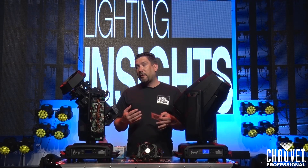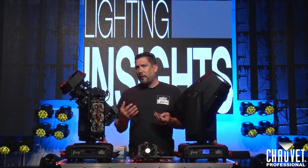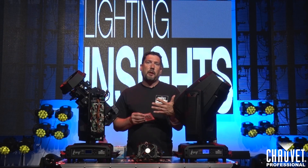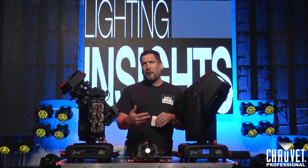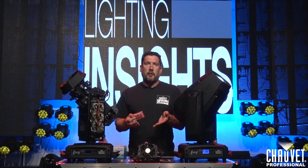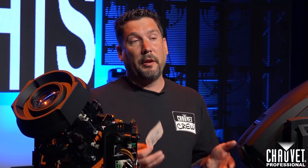If you're going to take the time to clean your optics — which is a really good idea when fixtures have been on tour exposed to dust, grime, fluids, and pyrotechnics — these atmospheric elements can cause major problems inside your fixture and reduce output because particulates gather on your optical systems. Avoid using a generic paper towel or your t-shirt. I recommend going to the drugstore and getting some gauze pads. They come sealed in a package, they're lint free and dust free, so you're not adding more stuff to your fixture as you're trying to clean it.